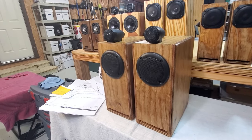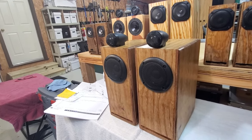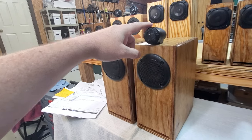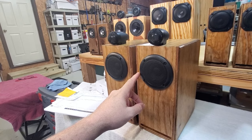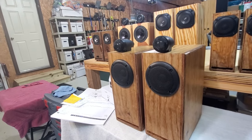I was using several calculators and modeling in XSim and testing with REW. And I ended up with an unusual thing, at least for me, the first time I ended up with a Butterworth crossover, a slightly lesser slope for the tweeter. And I stayed with the Linkwitz-Riley sharper slope for the woofer, and it seemed to actually blend a little better in the mid-range, so I was really pleased.